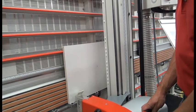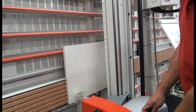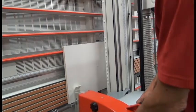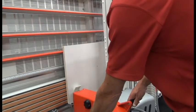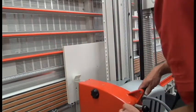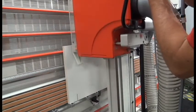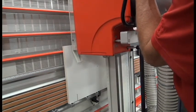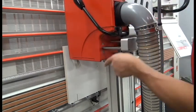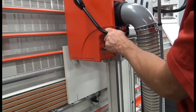I need to do this very slowly and carefully because I am climb cutting in the panel. Now I'll come down through, without moving the panel of course, from the top down. When I get close, I can pull the shroud away to see right exactly where I am with the saw blade.